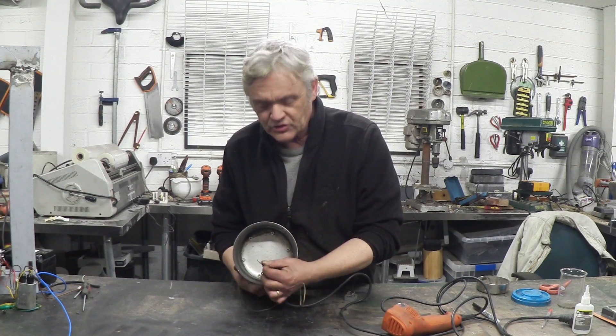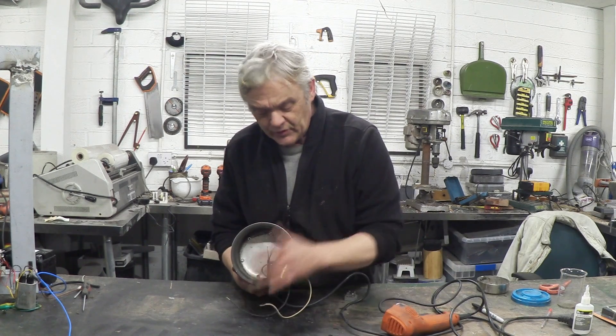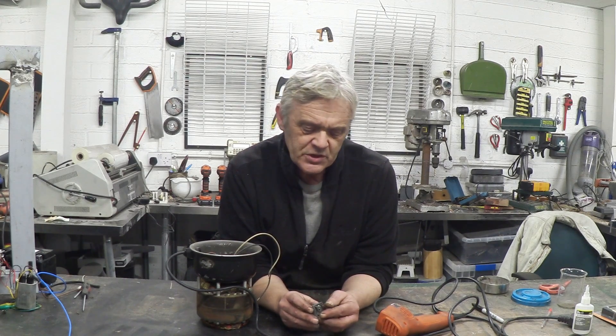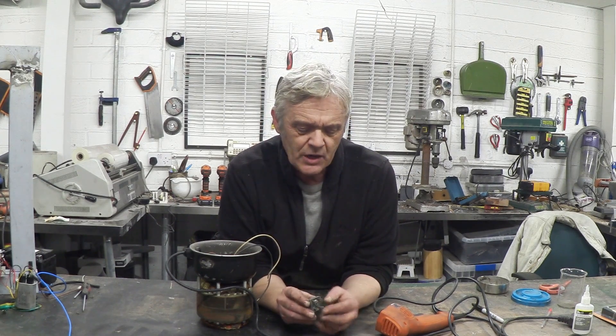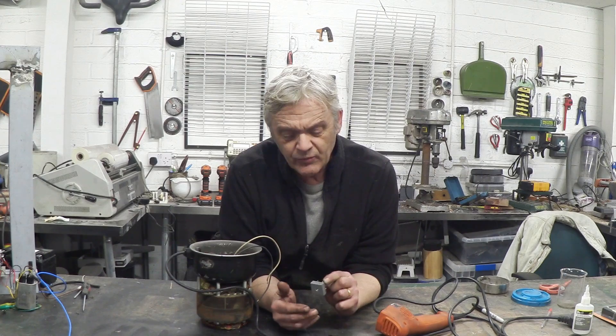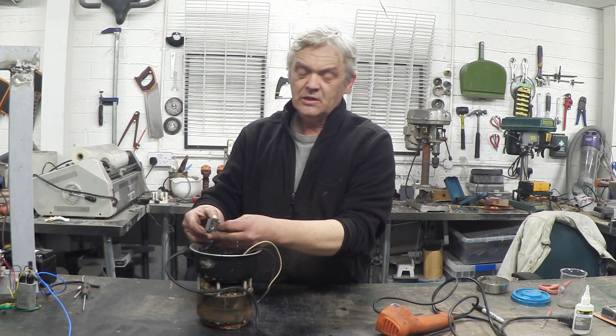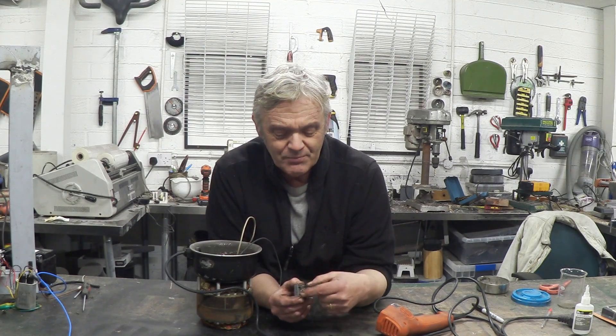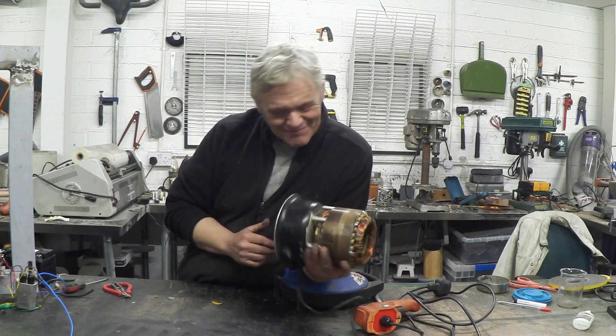Here are the two from our AC supply, so they go to the plug. Between these two we need to put our bridge rectifier. There is about 4 amps going through here, so you need to make sure your bridge rectifier can cope with that. When you get one of these, or you make one out of four diodes, they're always marked up - this one's the plus, this one's the minus, and these two are the AC. When we put that on the AC, two go there and there - it doesn't matter which way around. The plus obviously goes to there and the minus goes to there. Because this is going to the coil it doesn't matter which one is plus and which one is minus - we just make sure the input goes to the AC and the output to the plus and minus. And that's it - finished our scrap magnetizer.